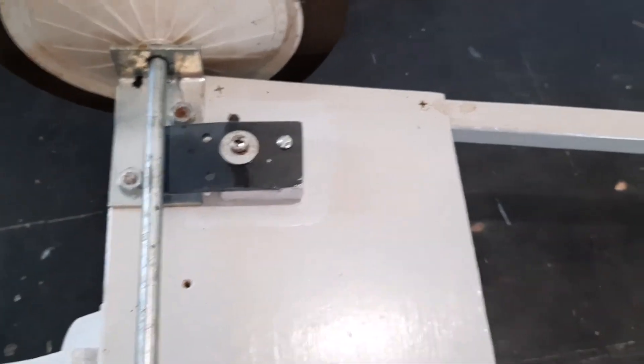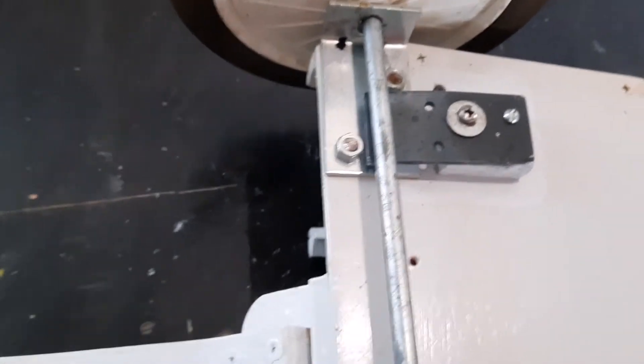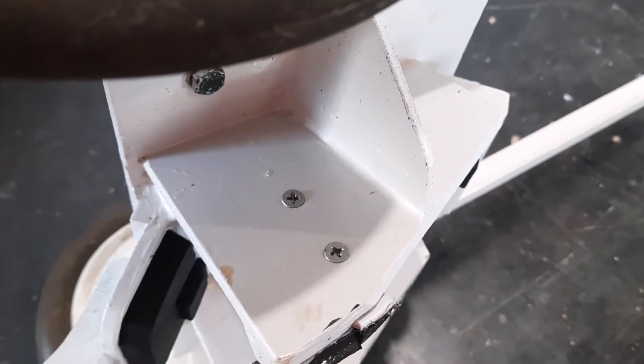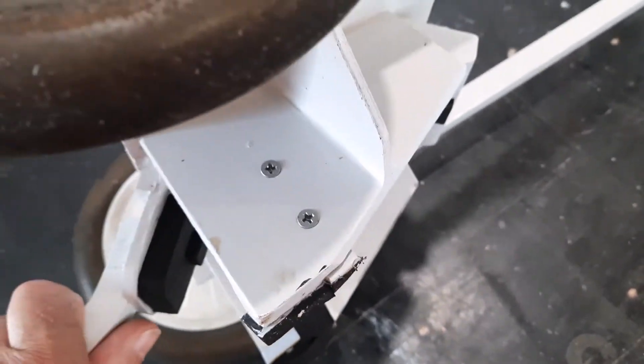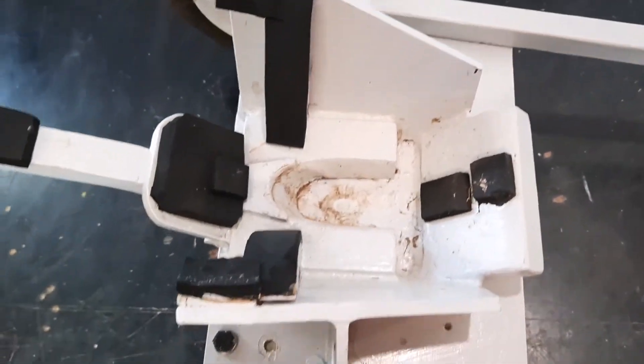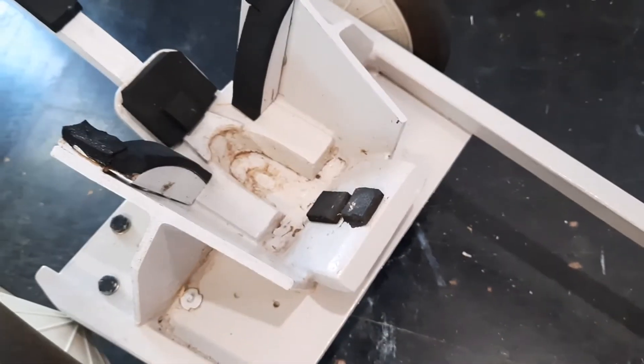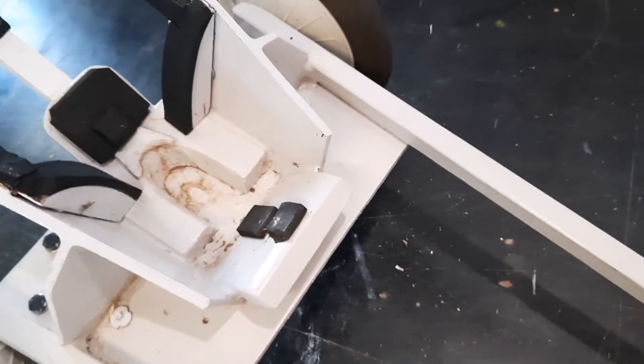After looking at the videos I decided to add a little more. These pieces of timber that go to the back — I've just used nice little wood screws countersunk in there. On the perspex I've got two holes drilled to soften it a bit — I felt it was a little too stiff. T-nuts in the front allow you to take that off and change the angle without it being glued. The side pieces also have countersunk screws so I can remove them. The bottom section is really heavy and thick — that was the original, probably overkill, but I just left it there.